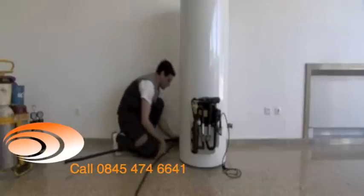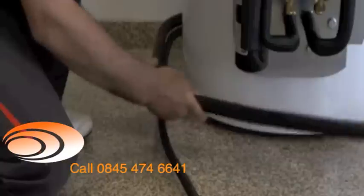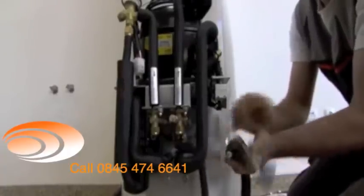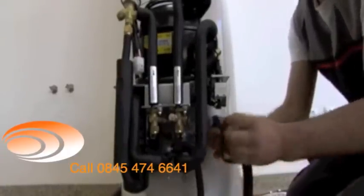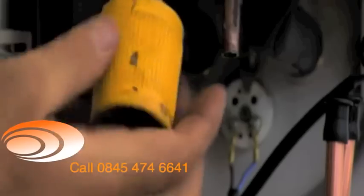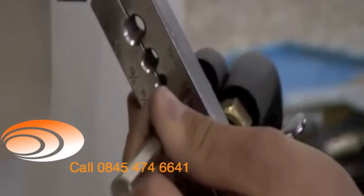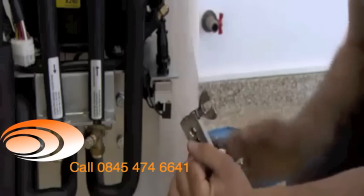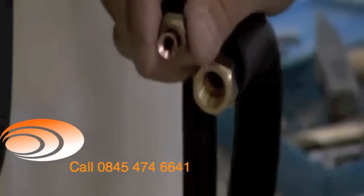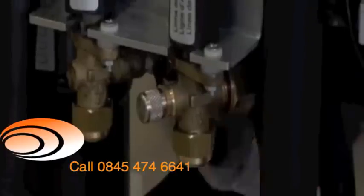The connection of the pipe to the block should be initiated by a correct measurement of the pipe's length. Use the pipe cutting tool to cut the tubes at the exact point of connection. With the reamer, remove all existing edgings without forgetting to put the lid back on. Repeat the steps to flare the ends of the pipes, not forgetting to place nuts at the pipe side and to remove the copper lids. Tighten up the nuts, initially by hand and finally with a wrench.